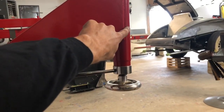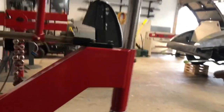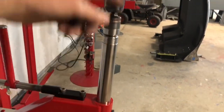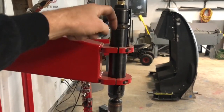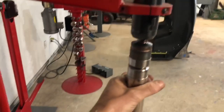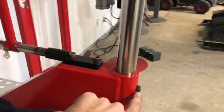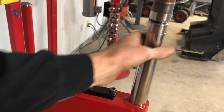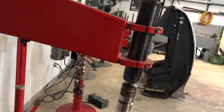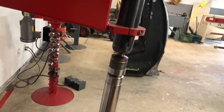I got this where I needed it and got it true. I filled it with mortar powder. I laid this in. What I ended up doing is, once my machinist got all this done for me, I put a piece of tubing in here. I clamped it down so I knew where center was. And I shoved it down, and it went over this a good ways. And what I did is I cranked it up to where it locked out, where it couldn't go any higher. And what it did, it locked it in, and it kept it true to the center pin of this. Then I came in and I ended up welding it out and let the heat cool and pull it back.